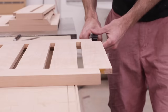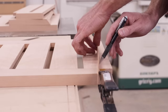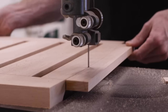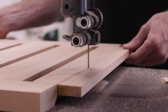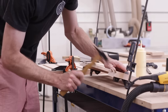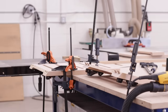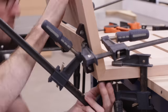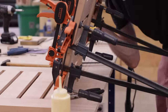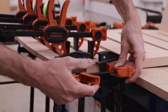At this point, I also decided to add a subtle curve on the top and front edge, so I marked out a curve that I thought looked good and cut it out using my bandsaw. And with that, I was ready to glue up the seat and get it into one piece so that it was actually a seat. Sometimes glue-ups can be tricky and stressful, and this certainly could be one of those, but if you break it all down and have a good strategy going into it, they don't have to be as daunting as we think. We included all the techniques and tips in the plans to make all of these glue-ups as stress-free as possible.